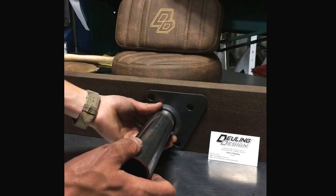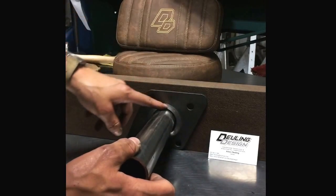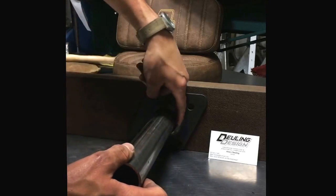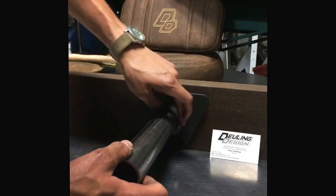Slide the plate down. The dimple in the plate will cover your original weld. You can then stitch weld this along with the perimeter and then plug weld all these holes.